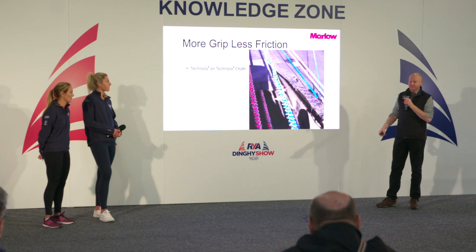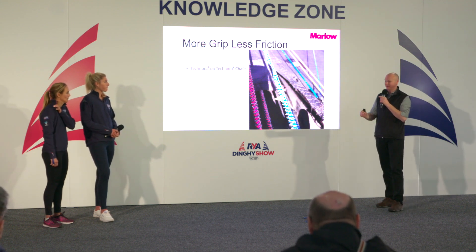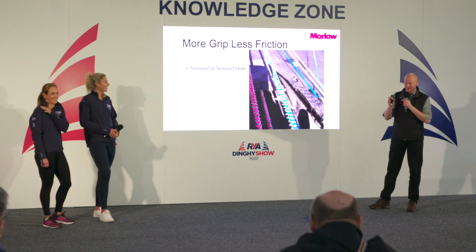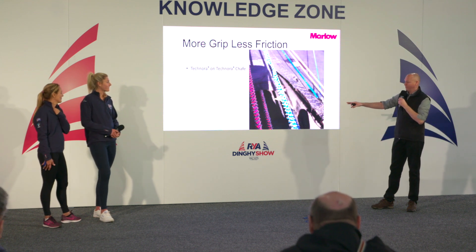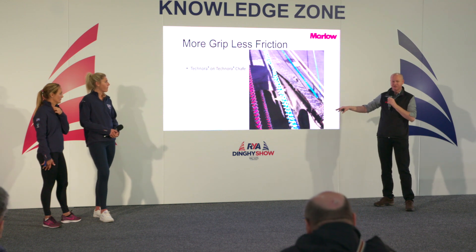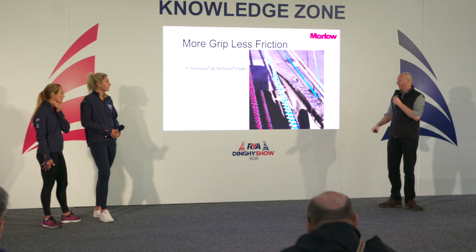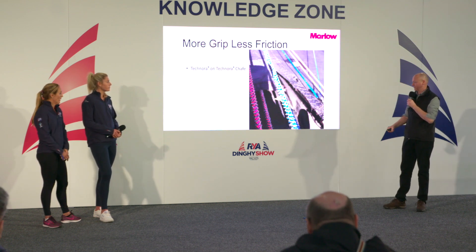You'll increase your friction in the system by 25% running multiple lines together. I had a couple of German guys at foiling week with really sticky systems — after separating them, one came bouncing off the water with a grin saying 'wow, it's so easy.' Single systems, each on their own — don't double them up. As we use more technora in ropes, wherever a technora rope touches another rope it's quite abrasive and will chafe and wear it, so if you start seeing that on your lines, look at how they're set up.